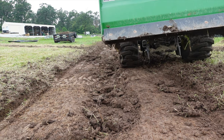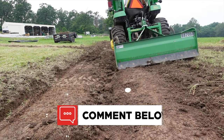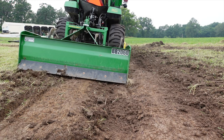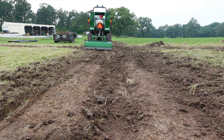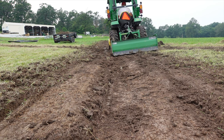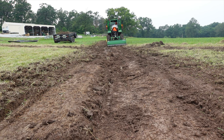I'm sure there are about a hundred ways to do this that might be quicker or easier, so feel free to tell me about it in the comments — though there's no rule against being polite, so other people can learn from your knowledge. This is a situation where it would have been really nice to have a top-and-tilt setup. I have the top cylinder but not the tilt cylinder, and if I did I could have made these passes more aggressive. I just made about 10 passes like this on each side and it deepened the swale each time.